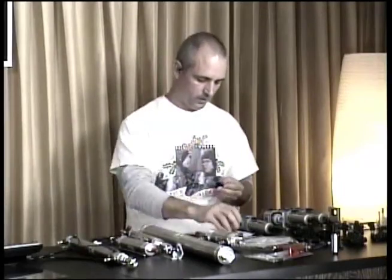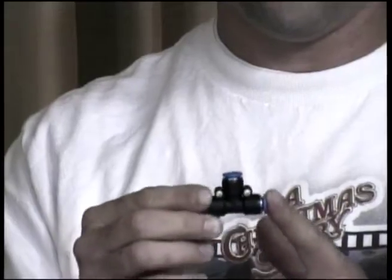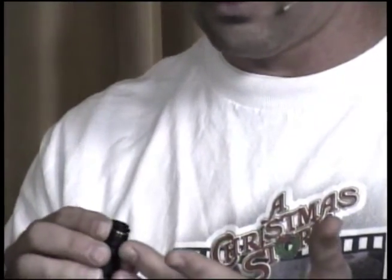So flow control. I've got a blue one here. This is a T fitting, and the blue indicates that this is a metric fitting for metric tubing. So it says an 8, so it's an M8. We carry all types of T's. We've got push to connect flow control. We've got some Y's in different sizes. This one's a 3/8 in, and it has a 1/4-inch out.